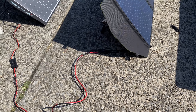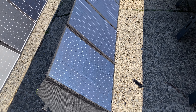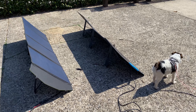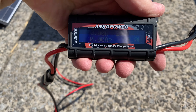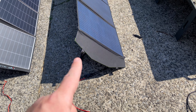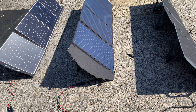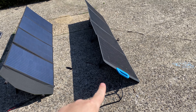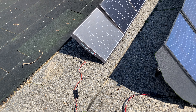The second contender is the SP033 — also 200 watts. Its open circuit voltage is 20.74 volts, so you can actually connect this to smaller solar banks including 300W and 600W units. Typically 800W and up can handle up to 30 volts, so the PV200 at ~25V needs a slightly bigger bank.